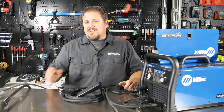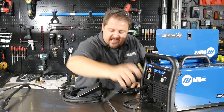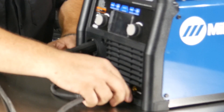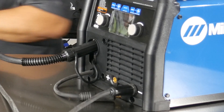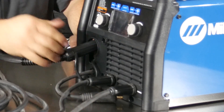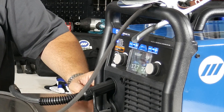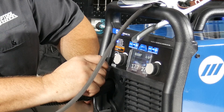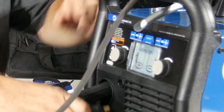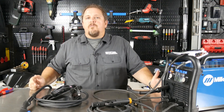We'll cover doing some TIG work in another episode, as well as some stick or arc welding. If we wanted to arc weld or stick weld, we change out the TIG torch, and we're going to be back to electrode positive. I'm going to put my work lead or ground back into the negative, and then my stick goes right into the electrode positive. All we do is go into the control panel, fire up the machine — it says input voltage 120 volts, still set on MIG welding — so I go through and select stick weld. It actually tells me where my negative or work lead should go, as well as where my stick should go. Now we're ready to arc weld.